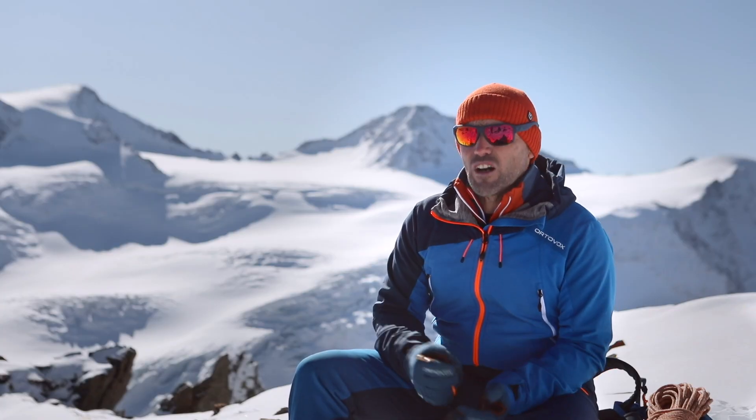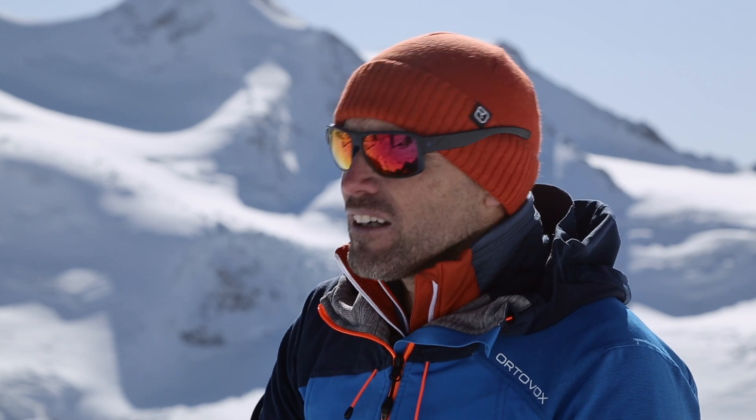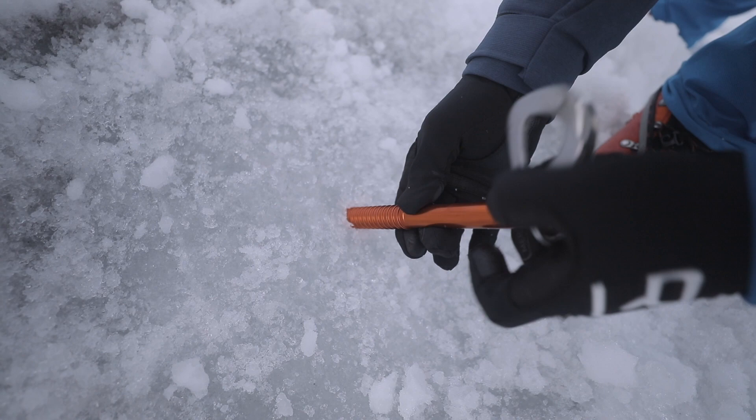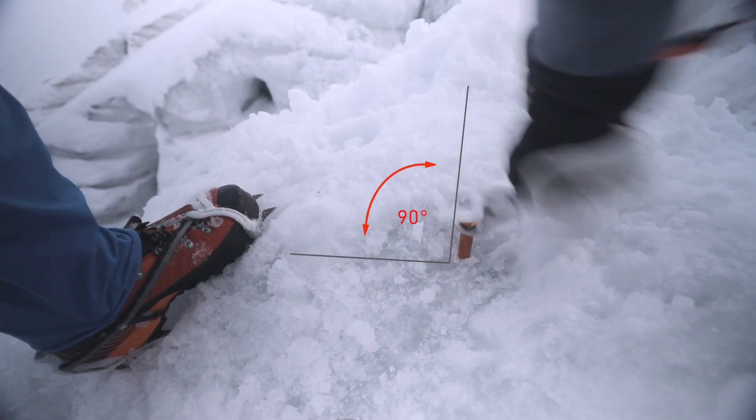This should not be in any way hollow. Then you place the screw perpendicular to the surface and give it five or six turns of the wrist until it begins to bite. This means that it is already gripping by itself and you can let go of it.